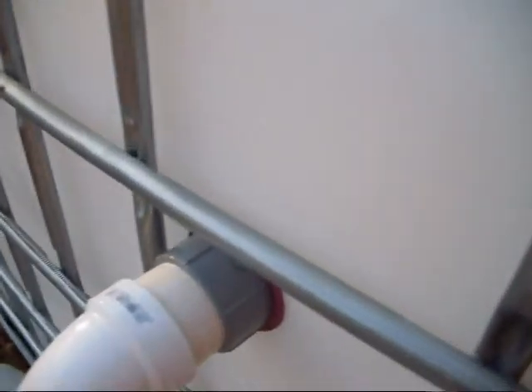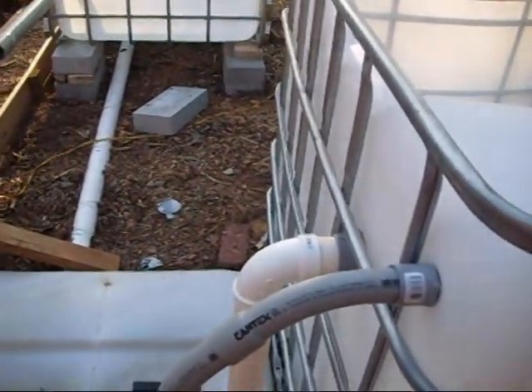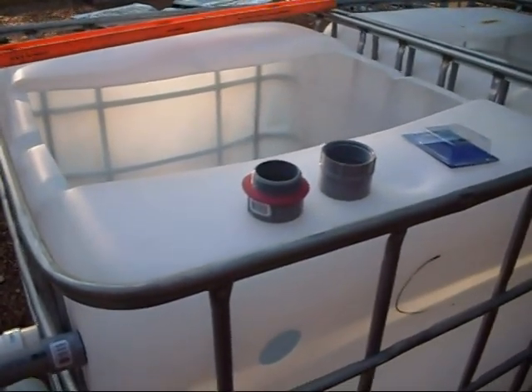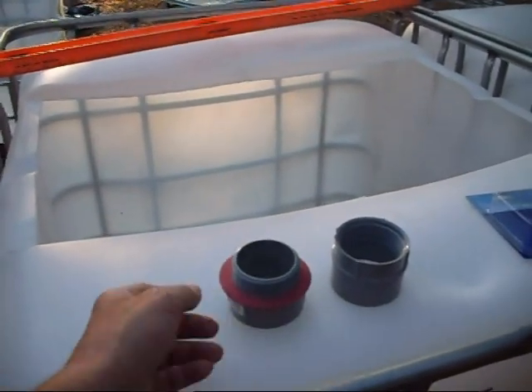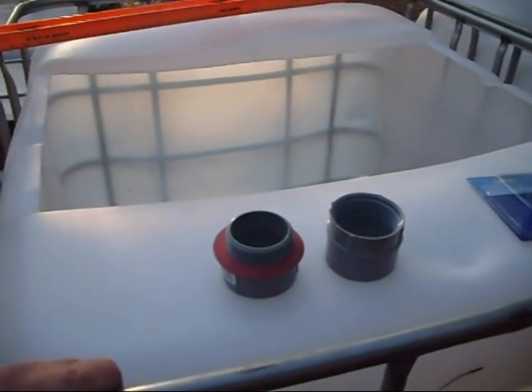If you want to see what one looks like when it's finished — there's the one inch with the number 18 O-ring, and there is the two inch with the flush valve seal. That's going to be the overflow for this IBC, and the one I'm doing in the back right now is going to be the solids lift overflow that's going to feed the beds — just an overflow going back to the sump in case the water level gets a little too high. An alternative to uniseals — very easy, very inexpensive. These fittings are about a dollar a piece at Lowe's or Home Depot, and this washer was $1.78 at Lowe's. So for $3.78 plus tax, an alternative to a uniseal that works just great.